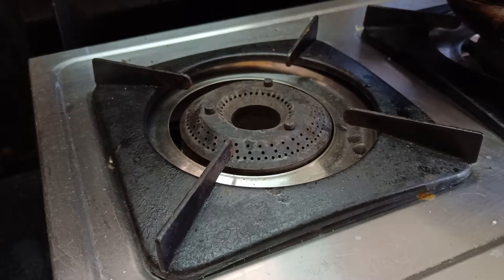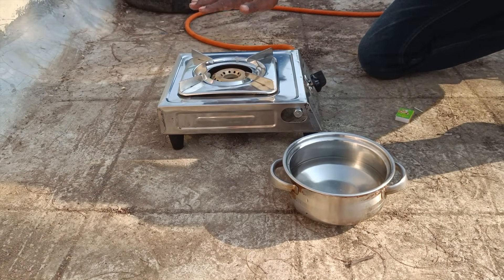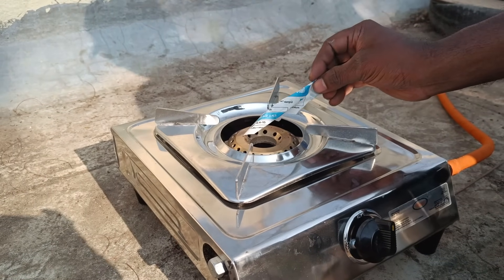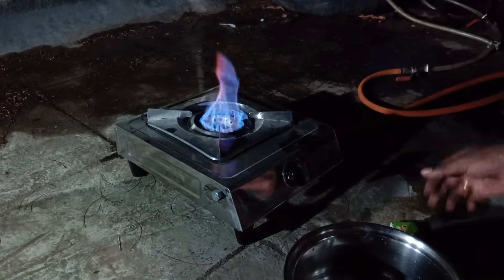Then I close the valve to the tube, open the exit valve, remove all the air from the tube, close it, and reopen the valve to the tube. All we have to do now is wait — it takes about a week for the microbes to produce gas. After a week I was truly excited to see it working. Testing a couple of days later showed the system working well, but this gas cannot be connected to a regular LPG burner — biogas burners have slightly larger holes. I bought a biogas stove and tried cooking; the flame is nearly invisible in daylight, but it does burn.